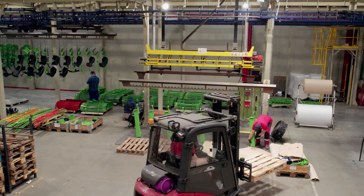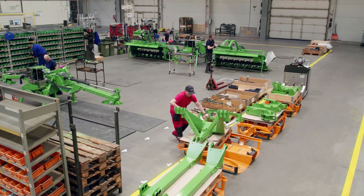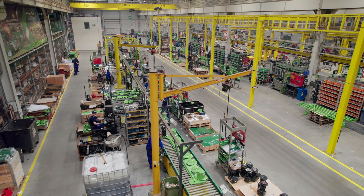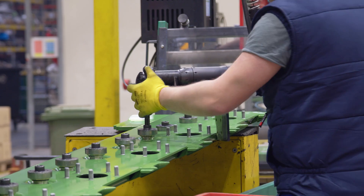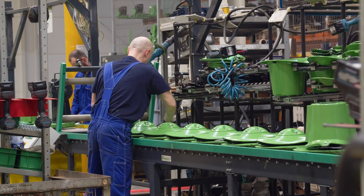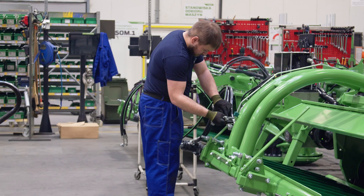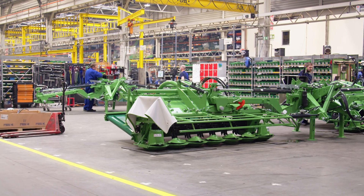The particular components are picked by the logistics department and then transferred to assembly lines on a logistic train. To optimize the entire assembling process, a step-by-step instruction is displayed on the operator's screen. The process of components assembly is controlled by advanced power tools with dedicated software. All data on bolted connections are registered in the computer system. In the next workstation, the hitch is assembled and then coupled with the swivel and support arms. Afterwards, the hydraulic system and control blocks are installed. Finally, the conveyors with guards are assembled and it's done.